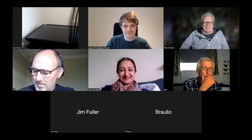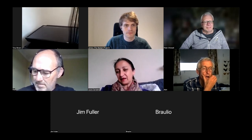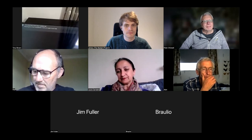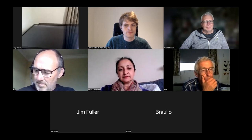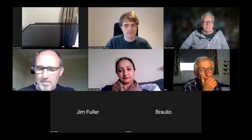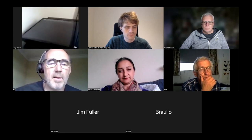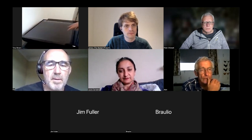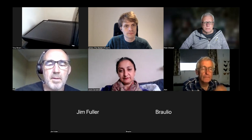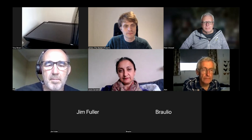So what I'll do instead is explain how to check. Now, can you see at the top, it's got this thing that says no channels have been added yet. Please go to the installation menu to add channels. Now, if the backlight on the set hadn't come on, you wouldn't be able to see that, right? But nor would there be an LED on the front here, okay? So what's actually happened is the TV has gone through its power on process, but there's no backlight and therefore there's no image. Does that make sense?